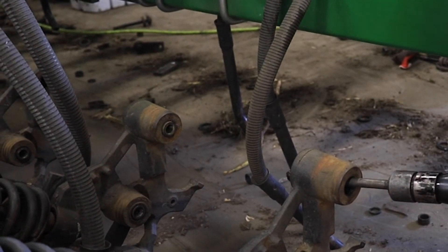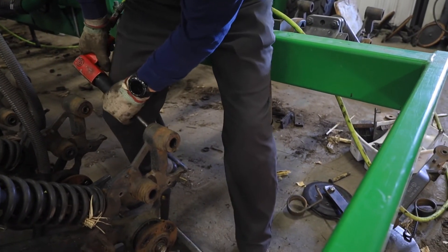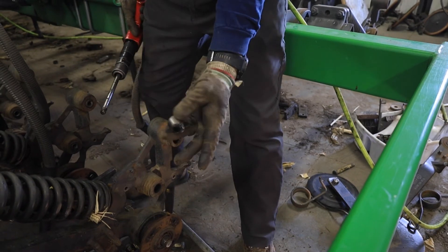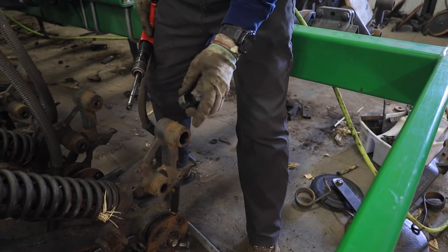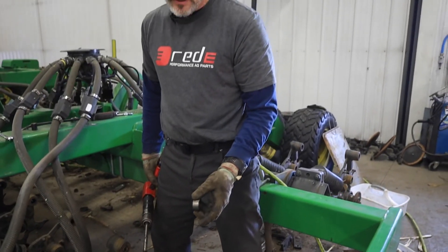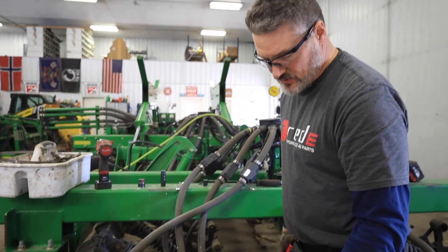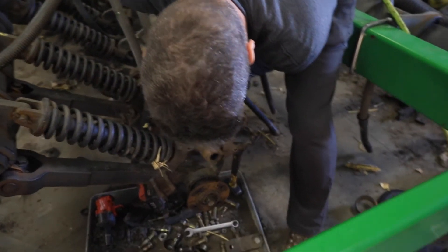As you can see, they'll go flying, so just be aware they will come out and you could hit yourself or other people. This is a bushing we've run out, and you can see the seal came out as well. Some of the newer drills have a seal on there, and our kits that we do with the greaseless pivots actually do have a seal that goes with them. We are converting this to a greaseless pivot, but we're going to use bearings instead of bushings, so we won't need those seals in this case.